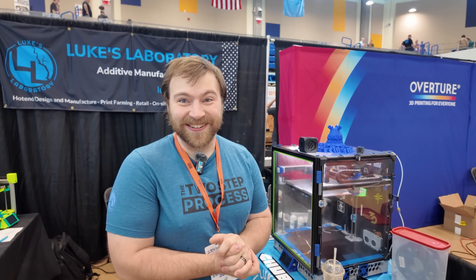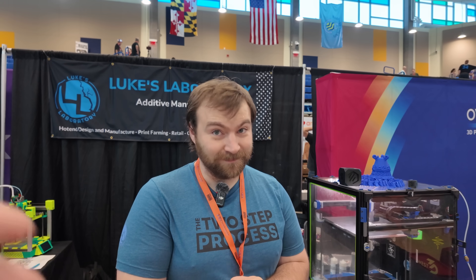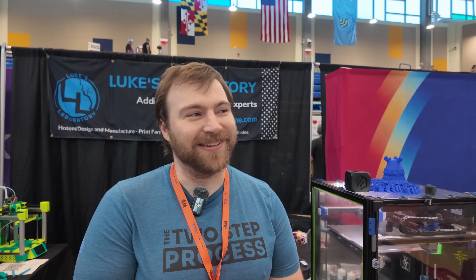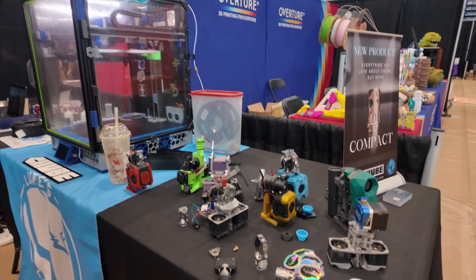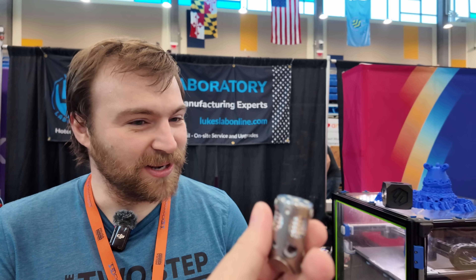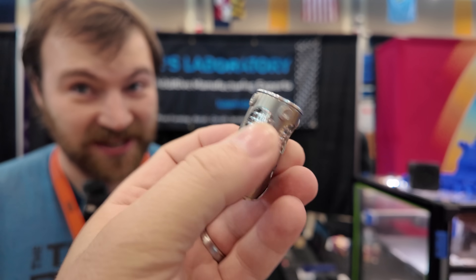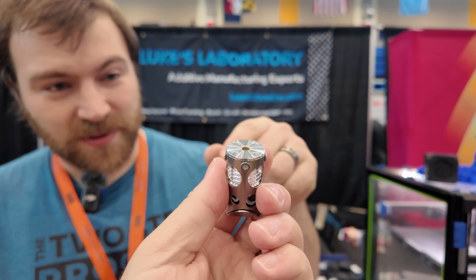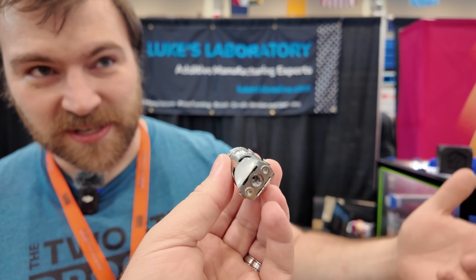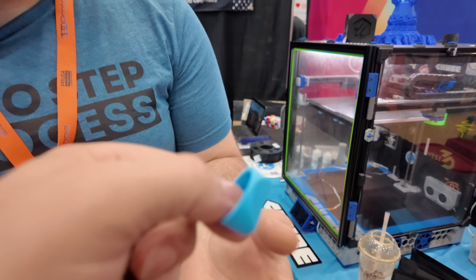I really love the fact that it's drop-in compatible. You don't need any special connectors — it uses standard V6 nozzles that you, me, and my grandma has a dozen of somewhere. Looking at the construction here, it's a bit shiny. Stainless steel? Nope. The outside tube, just like mainline tube, is titanium, not stainless steel. The lower shield is stainless steel because it's foldable and bendable. Something new coming with every single Compact — it'll come for the mainline tube eventually.